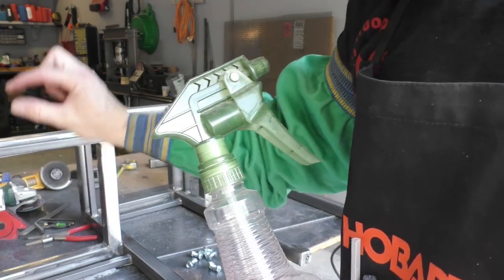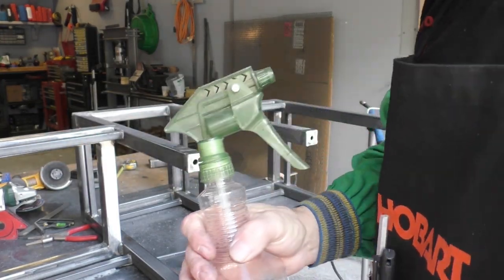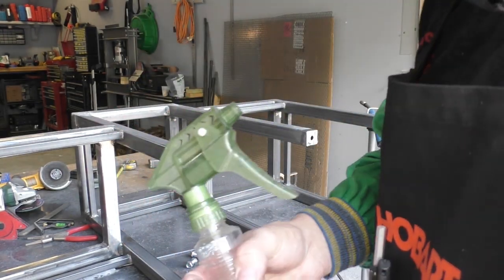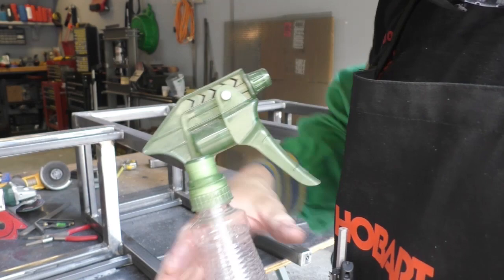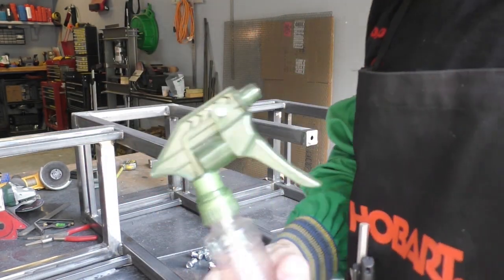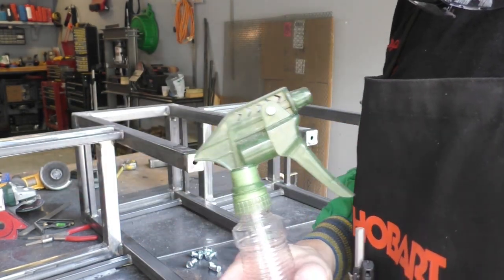Alright, I'm getting ready to do my bolts and nuts into the bottom of each one of the legs. And before I do, I'm going to start with some Weld Clean 350 on the threads and around here. It's an anti-spatter spray. I'm going to spray that on everything to try to prevent those nuts from getting bound up like the ones did on that original planter.